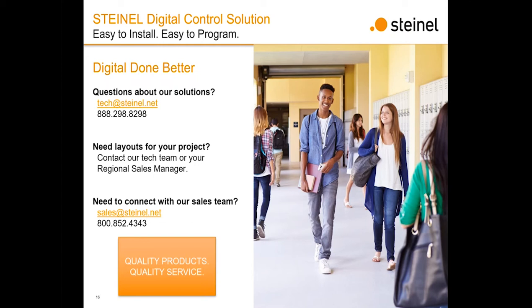Yeah, Sean, our first question is, is this system designed more for room control versus an enterprise system? Again, we try to get out of the room control philosophy or statement, but it is a lot more geared at the moment towards that. So again, three separate rooms or two rooms with a single zone and another room with two zones, as opposed to networking 30 DCSs together, is absolutely more doable and feasible with the DCS. So the full-on enterprise systems where you need the centralized server and to be able to control 30 floors is not the route and not the best for the current status of the DCS.